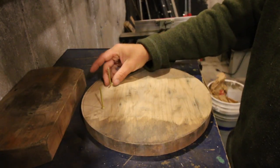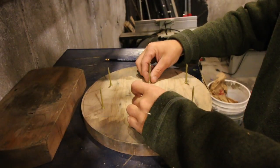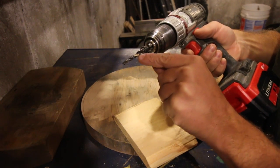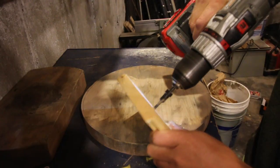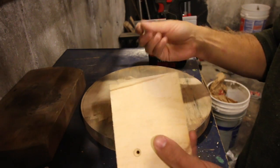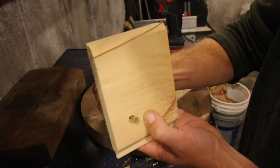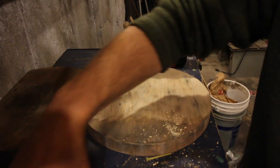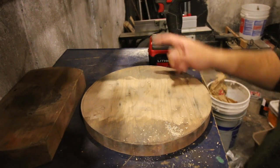I'm thinking a layout like this would work nicely. I'm not 100% sure that this is the size drill bit I want with the plunger on it, so we're just going to pre-drill a hole in a piece of pine. It gives you a nice hole for installing a plug, which we're not going to do, but I want to be able to countersink the screw head. I like that — I don't need to go that deep, but that's the perfect size. I'm going to pre-drill from the back side, then flip it over and countersink the holes on the other end.